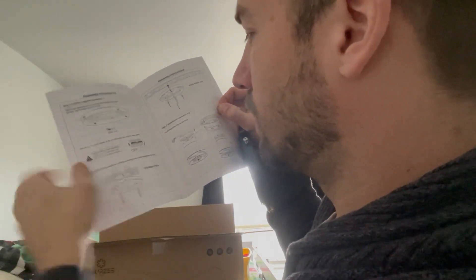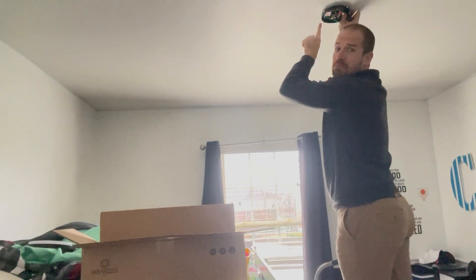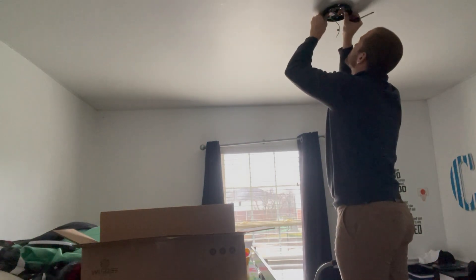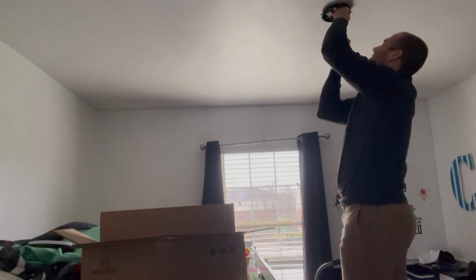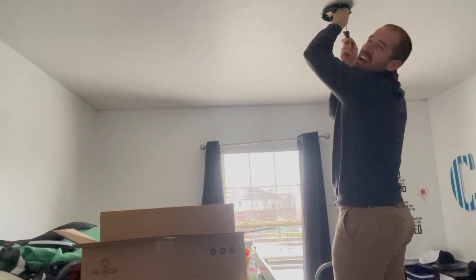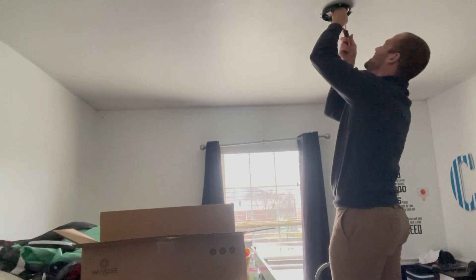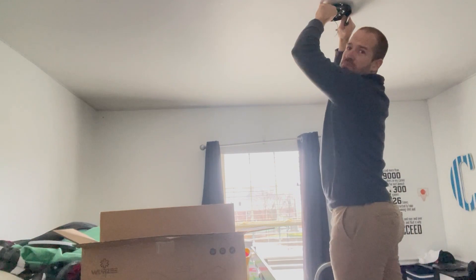Make sure your power is off, and go ahead and install. Mine is an octagon box, so let's go ahead and put this up. You feed the pre-existing wires through this big hole here so you can ultimately connect them, then put this bracket around so you can find the holes it needs to go in. If you're someone like me with no upper body strength because you haven't been doing your iron gym like you set up in college, sometimes you need to take a break. Alright, that's up there.